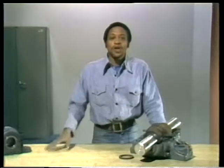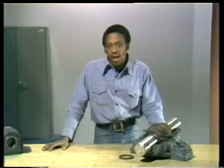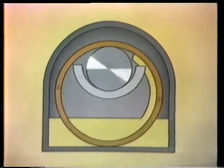The purpose of the ring oil system is to get a steady supply of oil into the bearing. You can see how the oil ring sits on top of the shaft — the bottom of the ring passes through the oil reservoir in the housing. When the shaft turns, the ring does too. Some of the oil sticks to the ring and gets carried up to the top of the shaft, then the rotating shaft carries the oil down into the bearing, forming a film of oil between them.